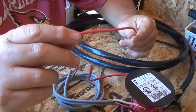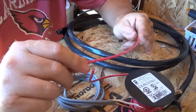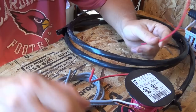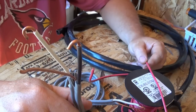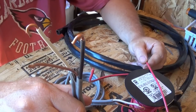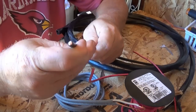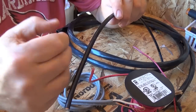That about covers the wiring. Most importantly, when wiring your system: know the amps going through that wire so you can size it up. It's okay to go bigger, but not okay to go smaller. Use stranded for DC applications — your 12 volts, 24 volts, 48 volts. Use solid after it goes through your distribution box at 120 volts. Run stranded from your inverter to your electrical box. If you're going DC all the way with no inverter, you probably want at least 6 gauge wire.